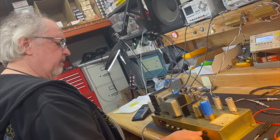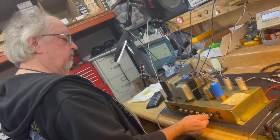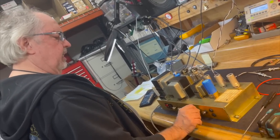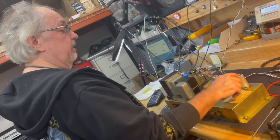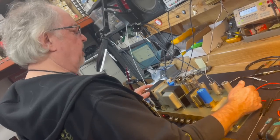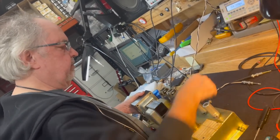When I turn the master volume all the way up, I hear hum, which is not unusual for an AC filament heated amplifier with a little bit of gain in the preamp stage. It also could be a little bit of leakage in the JJ 12AX7s, which are sometimes known to make a hum because of heater cathode leakage.